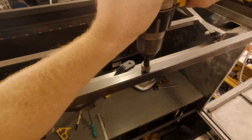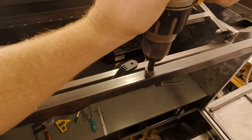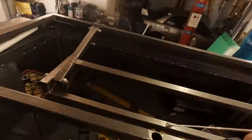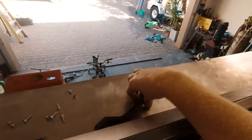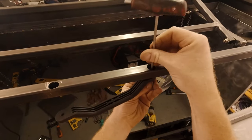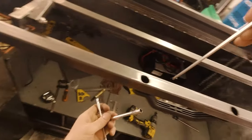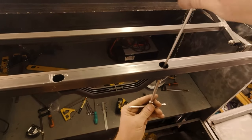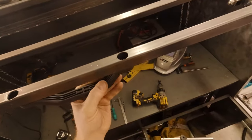Installing the handles, I use a small hole saw for the top hole. Keep in mind that after covering the top section I would not be able to access these holes to get my allen key in there. This way I can weld the bolt into place from the top, then having only the threads stick out the bottom — it's like having studs in there. Should a handle break or something go wrong in the future, I can unscrew and re-fasten them from the bottom. I sacrificed one handle here as I knew it was going to get burned while welding, but I had to be 100% sure they were in place. After pulling that trigger you're not moving that bolt at all, so I opted to weld them with the handle fully fastened.